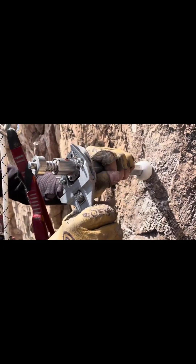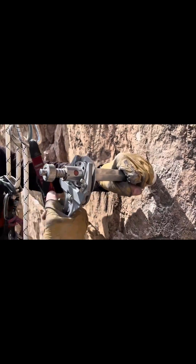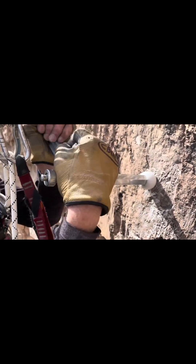We've just drilled the hole, I put the puller on and gave it a half turn, and it seems like it's going to slide out. No other damage has been done to the bolt in situ — it has not been released.